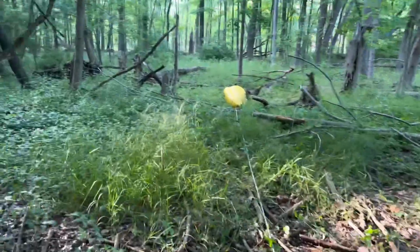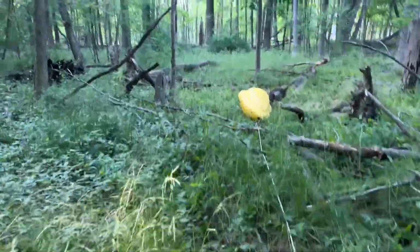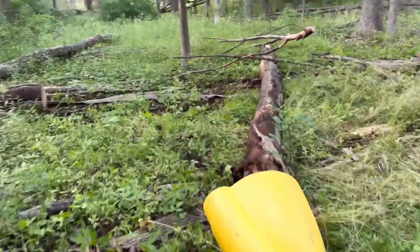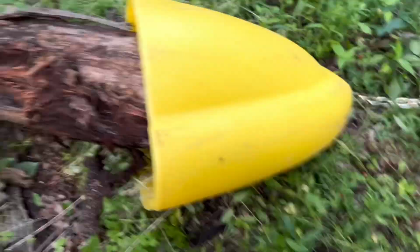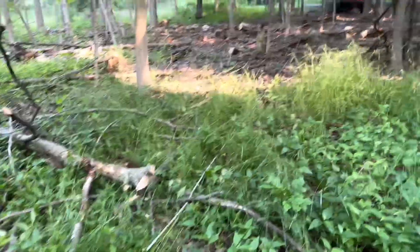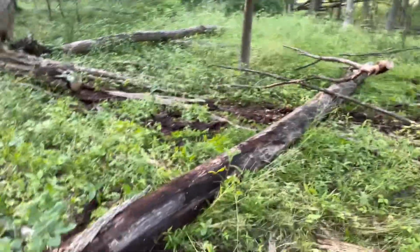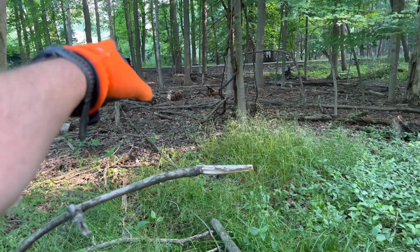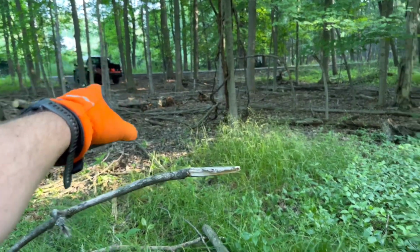All right, so I got a little bit bigger challenge for it now. I got a bigger log hooked up to it. I've still got my skidding cone here, but I got a decent sized ash log. One thing about the PCW 3000 is that it's got a 1600 pound pulling force. So if I feel like I'm going to tax the winch with this log, what I could do is hook up a snatch block to the choker, run the line over to that tree way back there, and